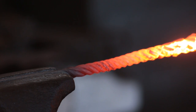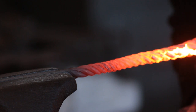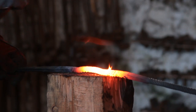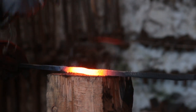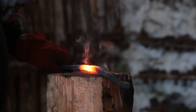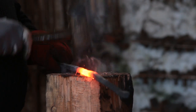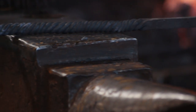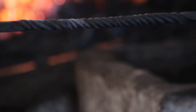Once your twist is done, head over to a wooden block and with a rubber mallet — you can also use a hide mallet — give it a bit of a straighten. Don't use a copper mallet because it will damage your twists. Continue until you have three twists. In a couple of spots my twists aren't quite even — I'm not massively bothered, though I did have to slow down the twist in a couple of places because it was starting to shear the iron.